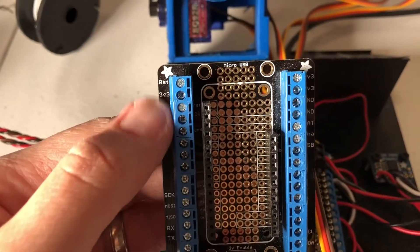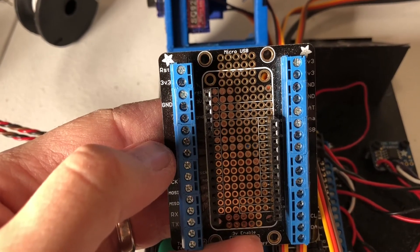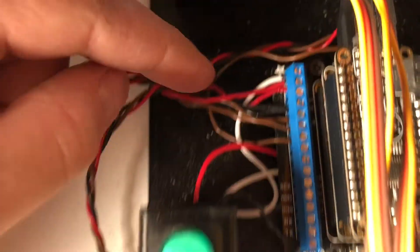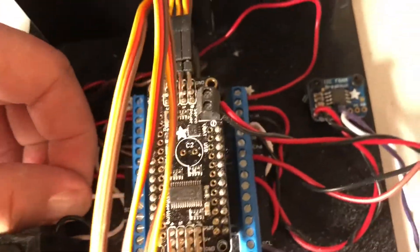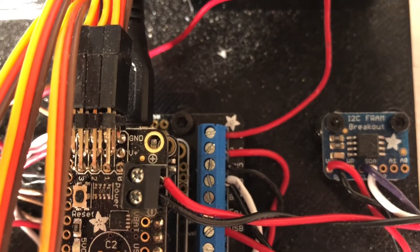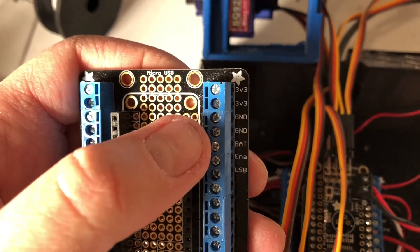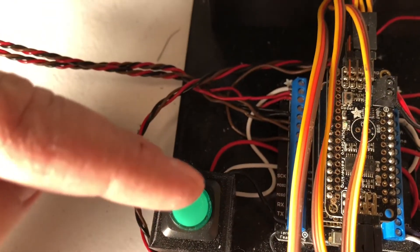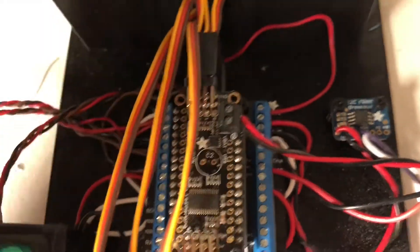If you look up the reset command on this board — if you pull that pin to ground, it will reset the board and start over. Notice my white wire goes to the reset pin, to the switch, and then because I ran out of ground pins, it goes over here — the fourth pin down, which is ground. Connect reset to the switch and from the switch to a ground pin. Doesn't matter which ground pin — if you've got an open ground pin, pick that.